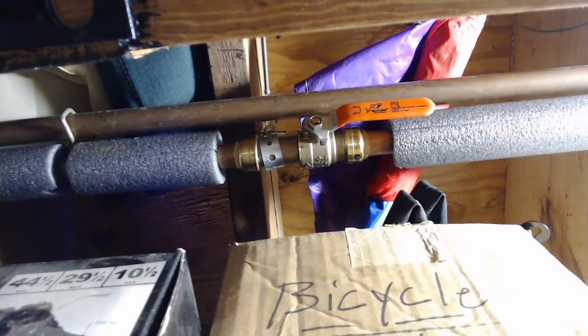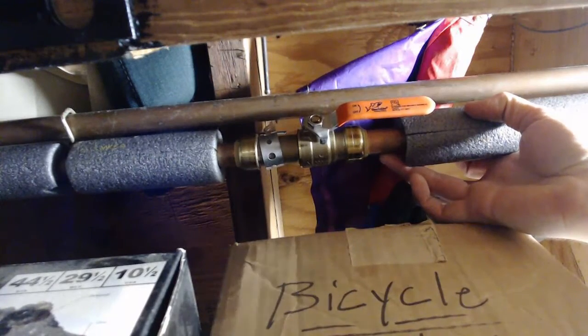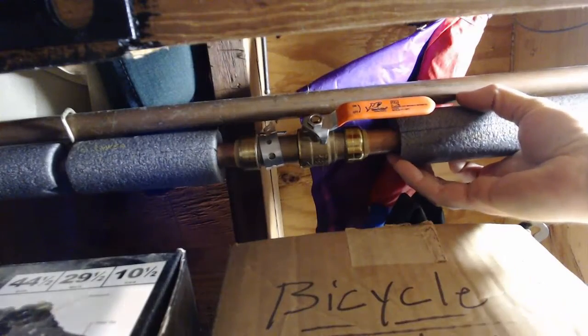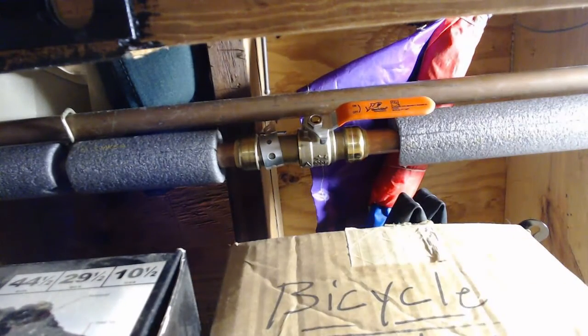And I will say it's one of the larger ones because this pipe is probably 3/4 inch plumbing pipe. And again, here's math, here's your fractions. 3/4 inch plumbing pipe is more like the main lines down around your basement. When we get up to sinks and faucets, that's more so going to be 1/2 inch.